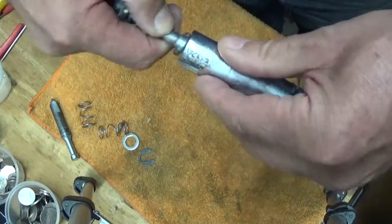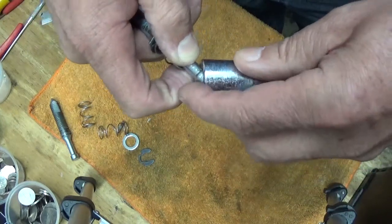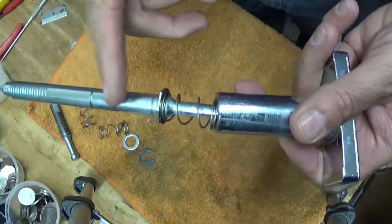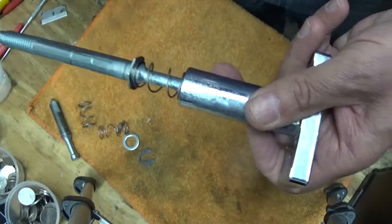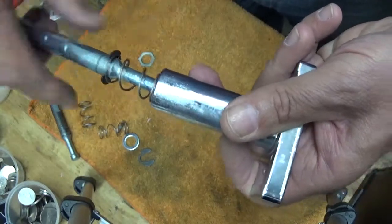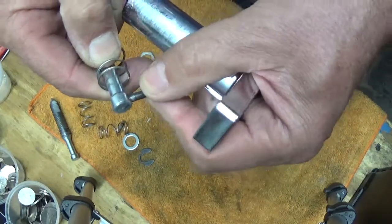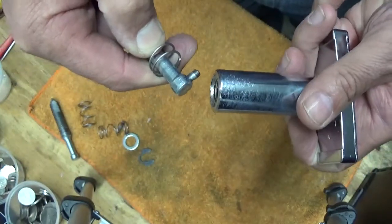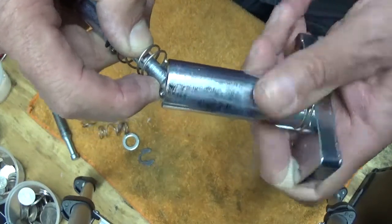But to get this back in now, it won't fit. You've got to do this. Viola! So once you've assembled this area — which I've sent you the pictures of — the spring has to go on this side. You put a C-clip, that washer — we don't have to worry about that right now. Then you take it out at an angle. That little roll pin can fall out, but to get it in, start with it halfway through, like this. And if it pushes through like that, find the sweet spot.